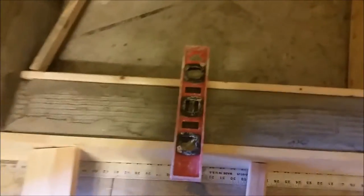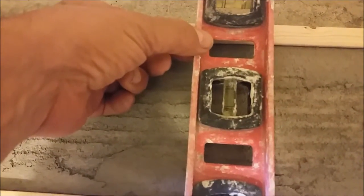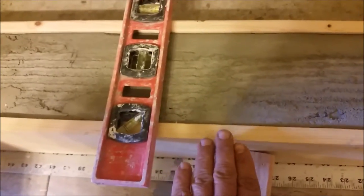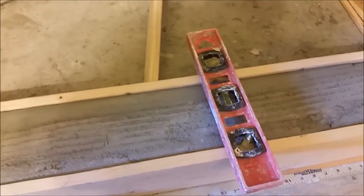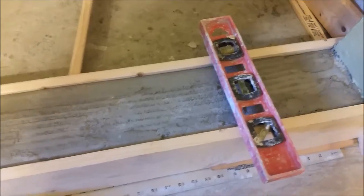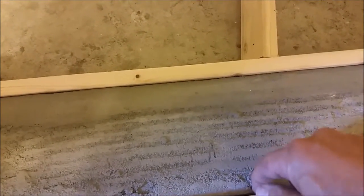The other thing I want to show you — I showed you before but now from close up — you see I have to elevate it in order to get horizontal. I am giving it up so we have a 1/8 slope. It is going to be perfect. All over wherever I put it, we are going to have a slope toward the shower bath. I attached these two borders because I don't want any space here — there is hardly any space for mortar to go down between them. I want it to be perfect.